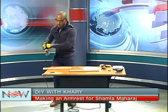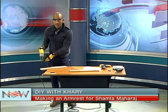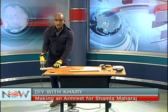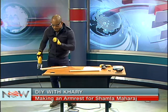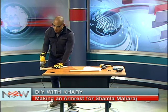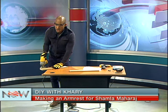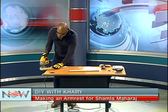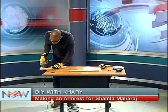Now I'm going to attempt to cut that curvature with my jigsaw. Make sure you move very safely — with the jigsaw, there's a base and you want to ensure it's on the piece itself. With a jigsaw you always start from the end, and you work slowly to ensure you don't force the machine — just let the machine go at its own pace. I have my mark here already; I'm going to line it up and try to get this cut as neatly as possible.